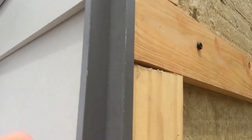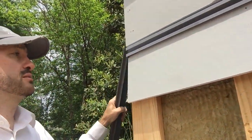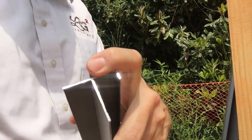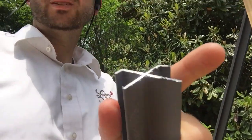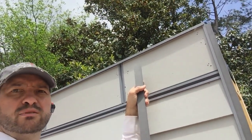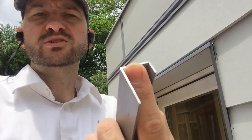This piece, this little leg here, is wider when you're doing lap siding, and when you go to a panel siding it gets a little skinnier. I've got a piece here that shows where you might have a lap meeting a panel at a corner — this one's a little thinner, that's thicker. Where you have lap meeting lap at a corner, it's the same width in both directions. At the tops where the termination of the panels is, there's an inverted J-channel, and we just cut the panels to butt right up against that edge so we have no gap.